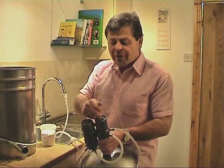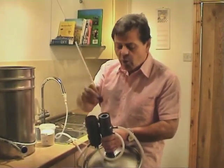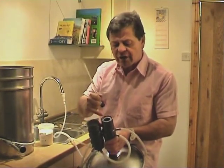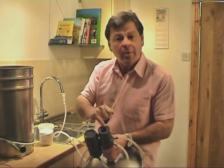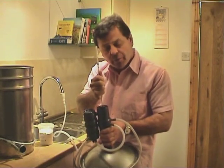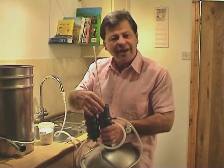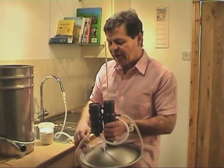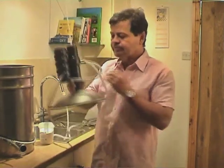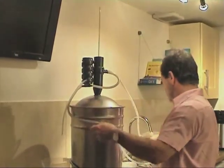So we've got the ceramic saddles. When you push this thermometer through the actual bung, we must be careful that we don't damage it on the bottom of the rough ceramic saddles. Now some people will actually put a marble in the top of this, so that if they do push the thermometer down too far, it hits the marble and won't damage it. I've actually never felt it necessary to do that, but that's your choice. With the thermometer now coming out of the top, this thing goes in situ on the actual machine.